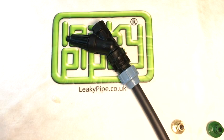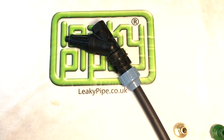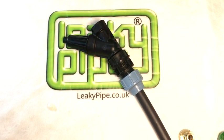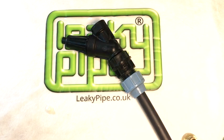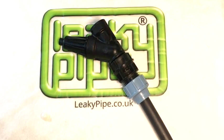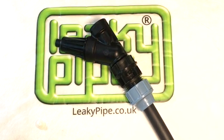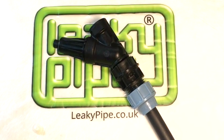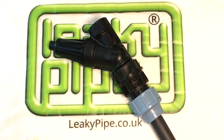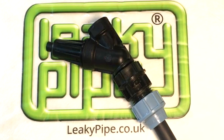This pressure regulator is not a step-down device and it's not a flow regulator. It senses the pressure immediately downstream of its position. The major benefit of this type of device is it has the ability to float depending on demand — if you increase or decrease the downstream demand, it will open or close accordingly. Likewise, if your water supply increases or decreases its pressure, it will automatically throttle the flow.